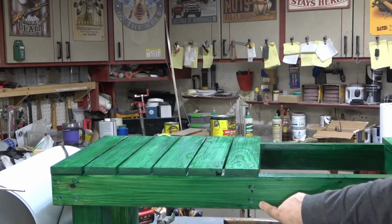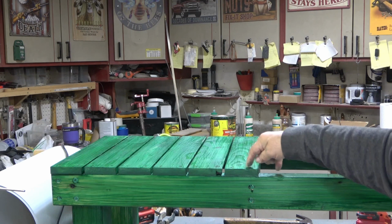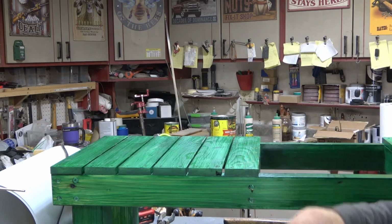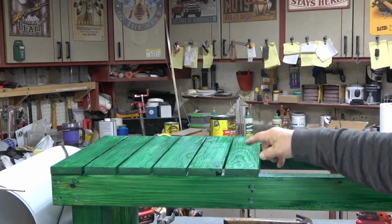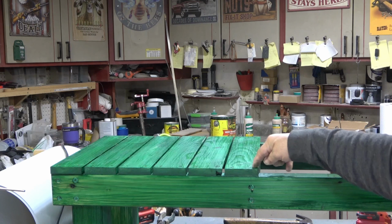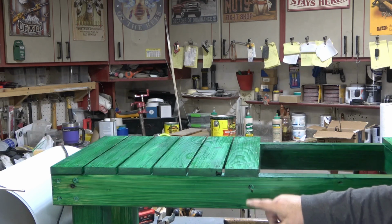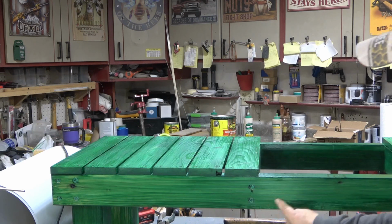These screw holes are set up with this screw here that you've drilled a hole in for the deck board. That's the center of the support board. And so that's the reason why you use this jig, is because this hole here will help you line up. Just drill your holes here. Keep in mind you have a screw that goes down in here. It's 1 5/8 inches. So you want to put this hole here down below where that screw would meet so you don't run into it. And then just symmetrically just drill them in. You don't need a template for doing that.